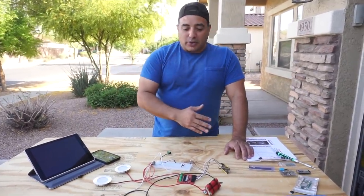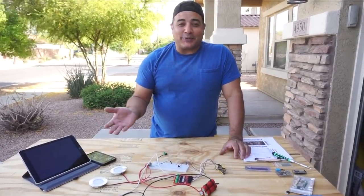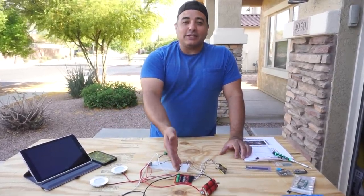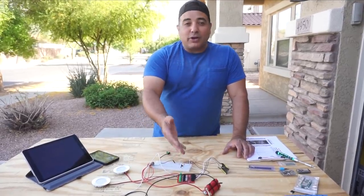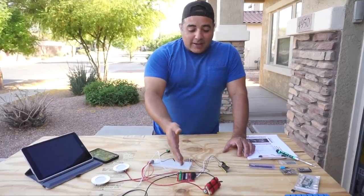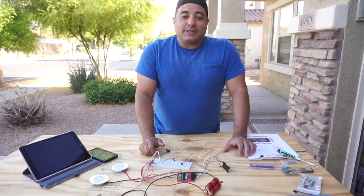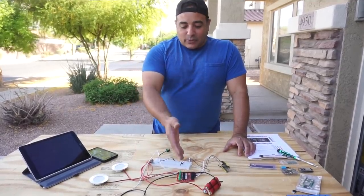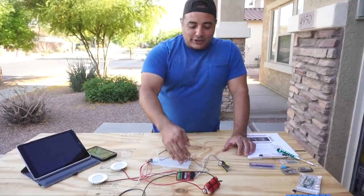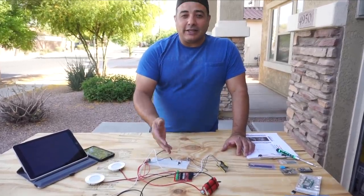If everything's broken, now if our MOSFET board is broken, then we're kind of sunk and we're out of the water. But hopefully these are pretty reliable. These get used millions of cycles. They are pretty robust things, and they're rated for 30 amps, and we're running about maybe half an amp through them. So we're being extremely kind to them. So there's no need for heat sinks. There's no need to worry about overrunning these boards.